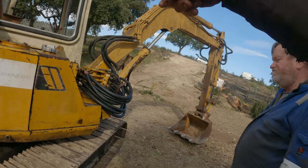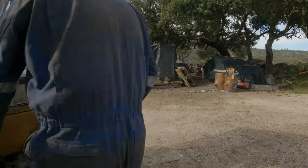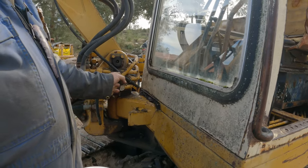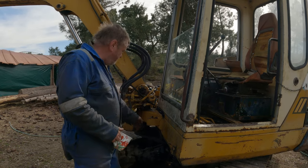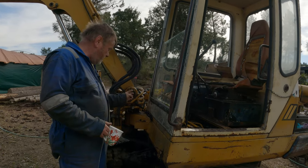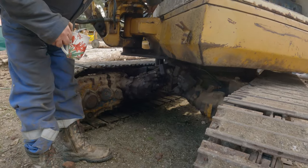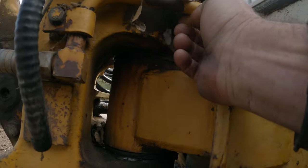So she shall henceforth be known as Countess of the Twenty Nipples. What's left? The slew ring area. There's one here, and there will always be one on this main pivot — on a wheeled machine that's the main pivot it turns on, and there might be two. You need to look and find them. The pin will be fixed in one part and swiveling there, and there'll also be one up here — might be around the other side. Oh, there it is.